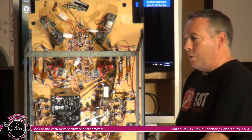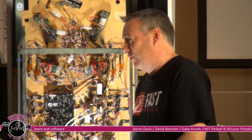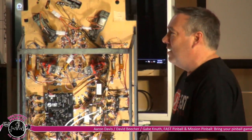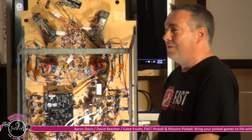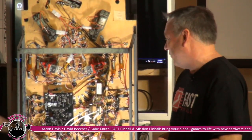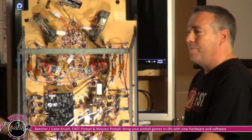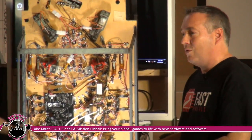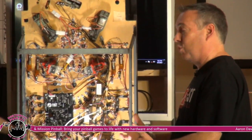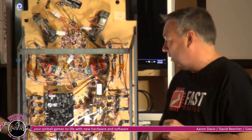Our board naming system is pretty simple: the first two digits tell you how many switches a board has, and the next digits tell you how many drivers. So '1616' means 16 switches and 16 drivers; '0804' means eight switches and four drivers. As soon as you plug a board into the system, if it has switches and drivers, it starts at switch zero and driver zero. If the first board has eight switches, the next board starts at switch number eight — so as the system grows, so do the resource numbers, always in order from the controller.